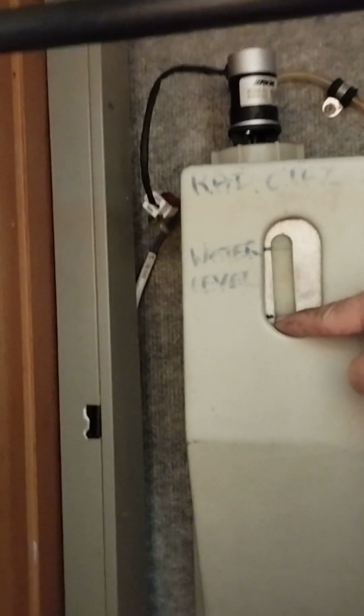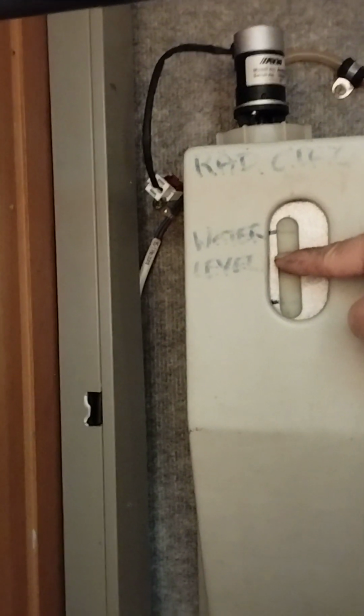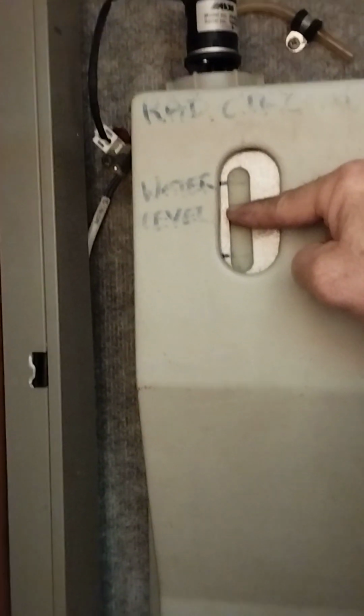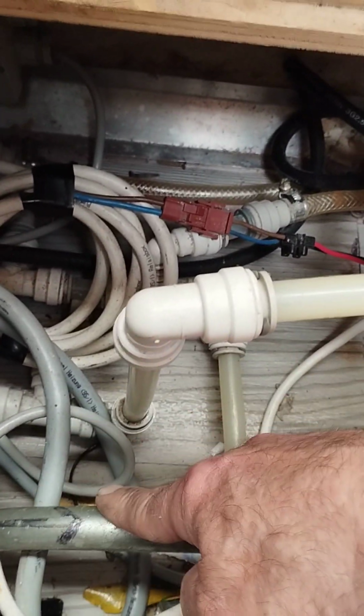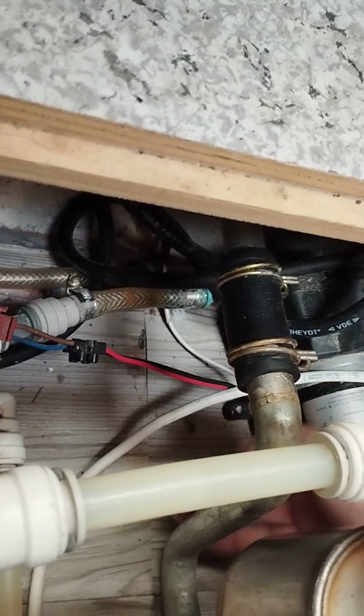and I went back to my top-up tank and the fluid was completely gone. So I topped it up. And when I say topped it up, instead of going the 10 or 15 mil above, which is the recommended, I went up about halfway. I knew that I still had fluid in it because when I tried to turn on the heating, I still had the problem at this cylinder. The cylinder was absolutely roasting and I still had a problem. This pipe here was warm, or hot should we say, but the pipe coming from under this cylinder was cold, it was basically freezing.